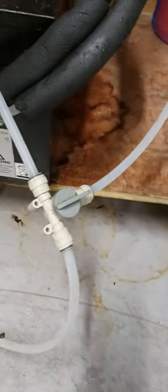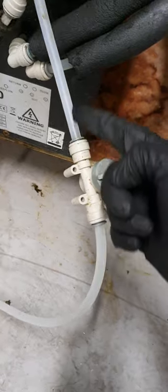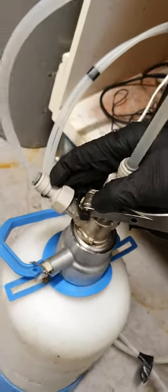So our gas is on, comes through the regulator — it's 160 bar going in, drops down to 2 bar through the regulator. There's a valve here which splits it. I'm using a Maxi 210 cooler with a two-line cooler, so I'm just splitting the gas into two — this goes to one tapping head, this goes to the other, into the gas side of the tapping head. I'll dismantle these in another video and show you how to overhaul them.